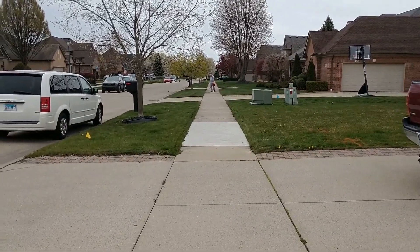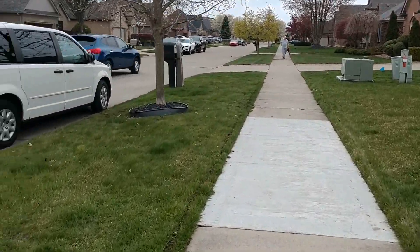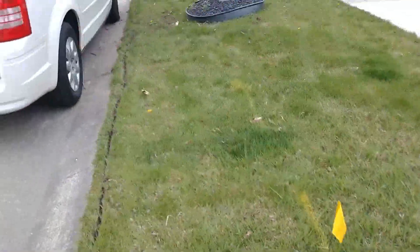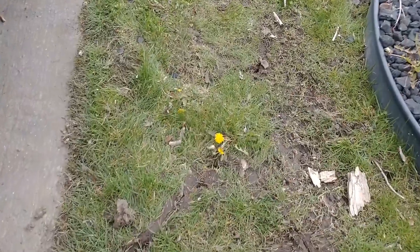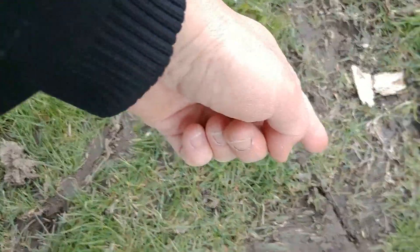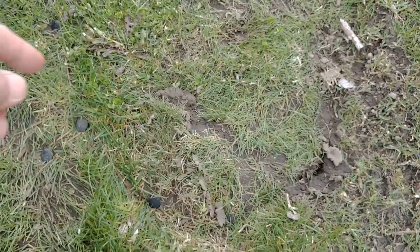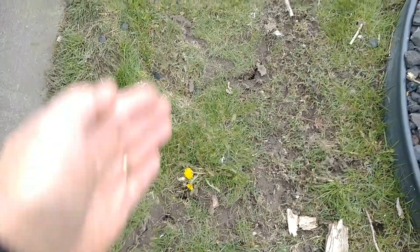I want to show the wire over here because I wired this tree, which is very common in these parkways, as a tight spot — you can see the cuts right there. This shape, I'm kind of small so it's really hard for me to maneuver the machine. It went kind of like that, which is really not ideal, not to spec. And then kind of like a U is a little better. The important thing is to have 12 inches between these wires so the robot will not drive over them.